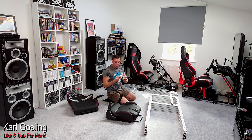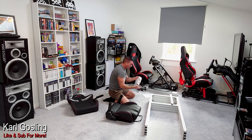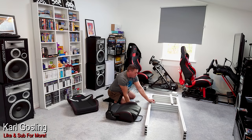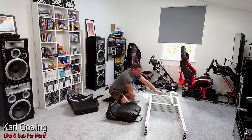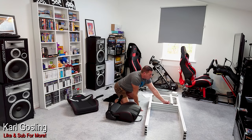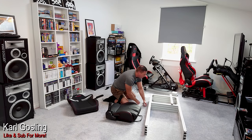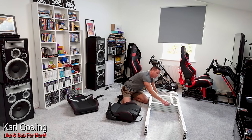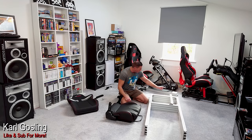So this is the point where we need those four corner brackets with the little tabs removed, because the tabs slot into the gaps in the aluminium profile and keep the brackets centralised. They can slide up and down but can't slide left and right. When we go to bolt the cross piece on here, the bar runs the opposite way — meaning if we had those tabs, they would prevent this from bolting flush with the profile. So there are four of these with the tabs missing, two for each side, and that's what they're for.